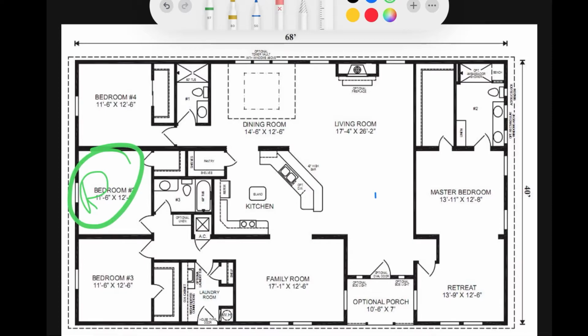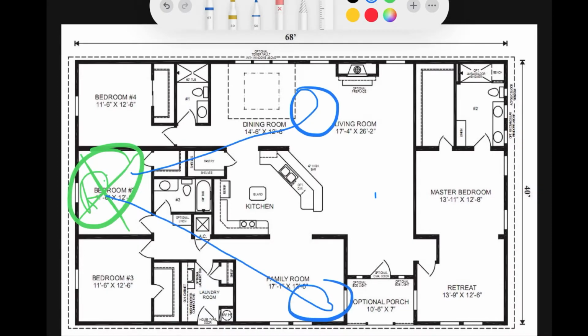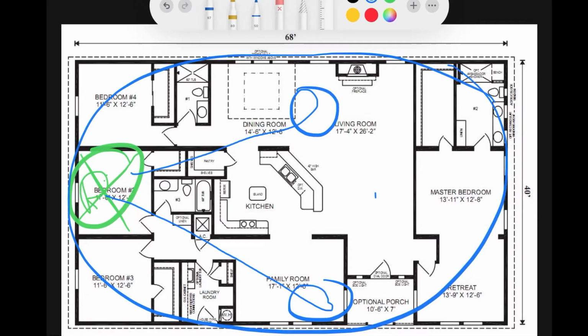The customer buys Orbi or Eero routers or the extenders. What we're going to do with the AT&T or Charter or Spectrum or Fios gateway is turn that Wi-Fi off. Then, following the instructions of the router, I'll test the spots. They'll say, oh, right here is a strong spot, so we'll place one here, and then, oh, this is a real good spot, so we'll place it here. So this gives you full coverage of the entire house on 5G because you have 3 points of access. So this gives you the entire coverage.